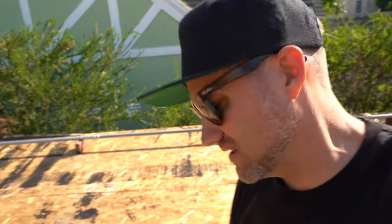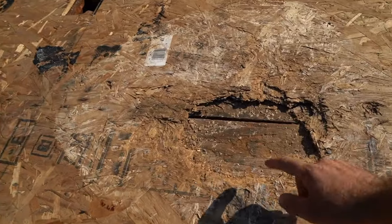Taking into consideration the problems I had with the roof in the past — like this spot right here — that's where water got through and damaged the roof. I don't see any other areas like that, but there was a slight ponding issue happening right here in this area. So what I'm going to do is cut a cricket into this roof, which is a small pitch that will allow the water to drain off to the sides and hopefully prevent this from happening again.